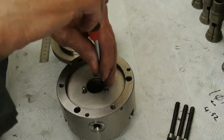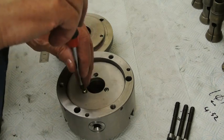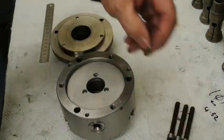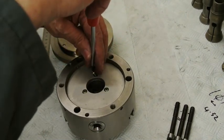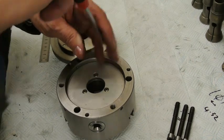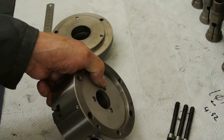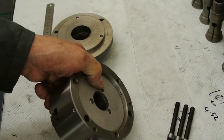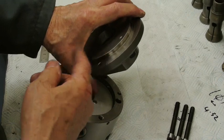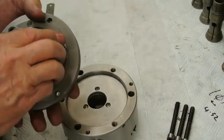What it does need is a chuck with an aluminium plate in here, because a plastic one would be absolutely hopeless — which is what I had in the other chuck. I've got that back in there and you can see the little grub screw just poking out of the side. It will fit onto the little flange there, so I'll put that back in now.